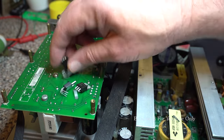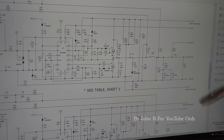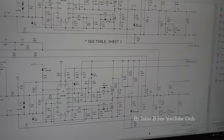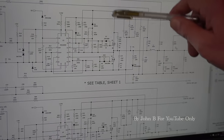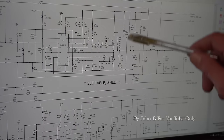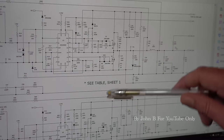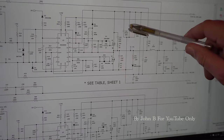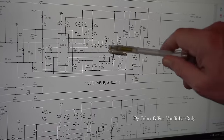And there's only one reason why two FETs on one channel will blow up at the same time. Let me show you. Here's a circuit drawing. So there's two of the FETs on one of the channels. There's one channel and another channel down below. Right, so for both of these transistors to go at once, you've got plus 75 here, minus 75 here somewhere, there. And this 500 watt amplifier chip, very similar to the PV and one of the Wharfdales. This 500 watt chip drives the positive half cycle and then the negative half cycle. So plus 75, minus 75, and the speaker is in the middle.